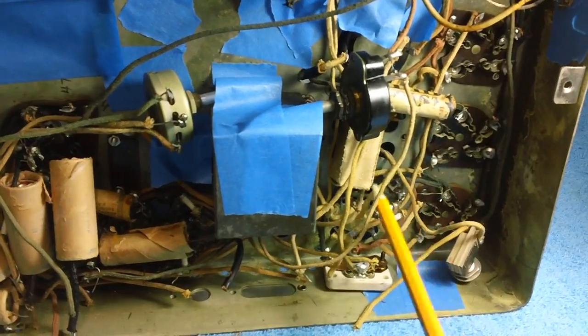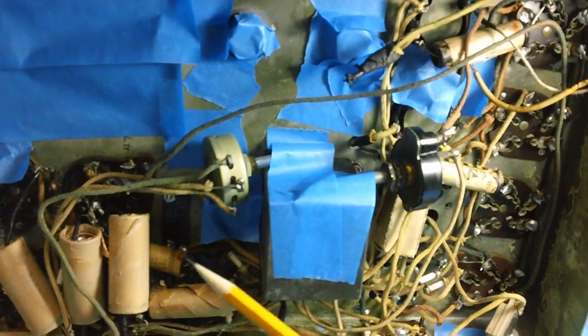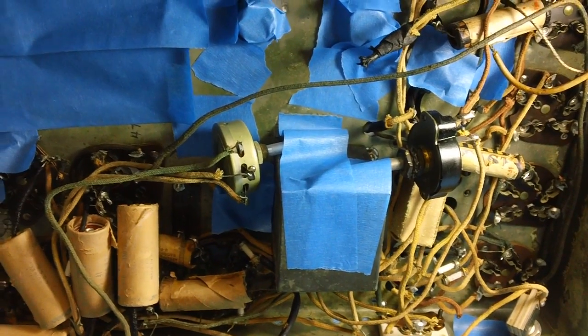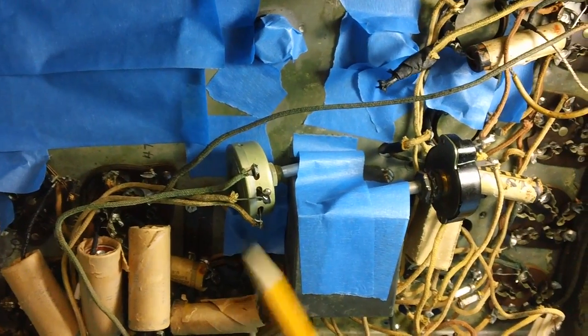And I wouldn't get one quite as complicated as this, although it's not very complicated compared to some of them I've done. Get yourself a small radio. It's really butchered up, really messed up. Somebody screwed it up over the years. Don't worry about it. Cut everything out. Get a hold of your schematic. Try to put it back together. And if you don't do it right, that's even better. You get to go back in and do it a second time, and a third, and a fourth.